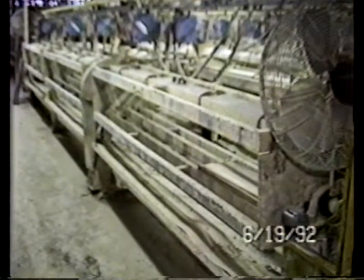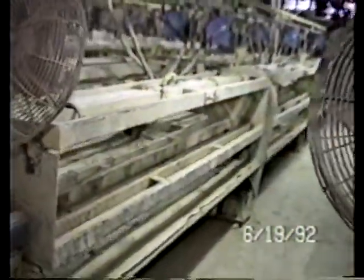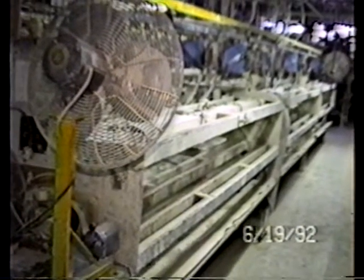Earlier in this tape, we referred to a number of these systems that are available. The number or count of what will be sold at the moment is actually 45 lines. A line at the moment will be presented consisting of all of its electrical controls and both sides of the line with the common conveyor at the bottom. Looking at this line, it consists of the side in view right now with its three sections of rack, its automatic tilters, and the one common conveyor belt which is on the bottom. And the other side of the line, which contains a twin, another three sections, and again the common conveyor at the bottom. Pumps for return of the fluid back to the tanks in recycling the material will be sold separately.